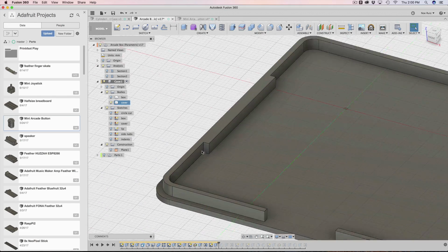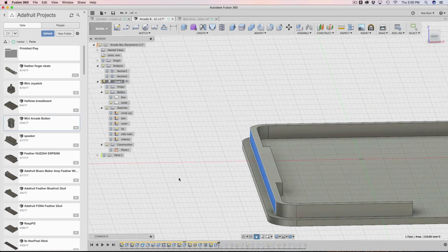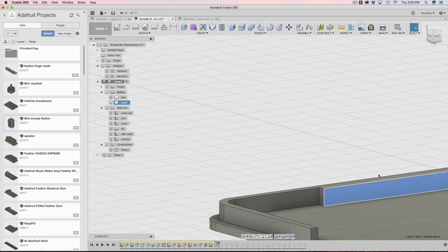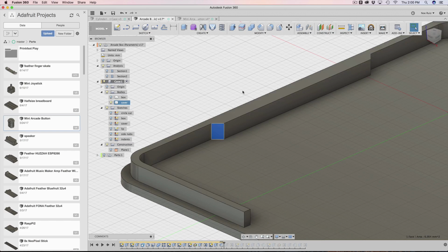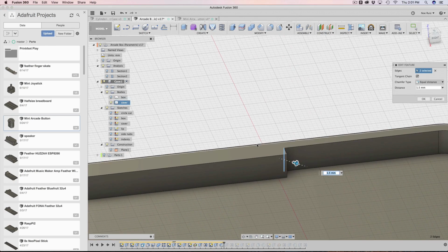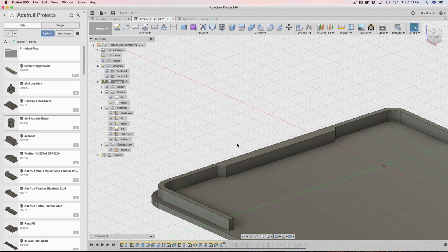So we're extruding the inset here because we need to have this extra material here, because if we just cut here first for the indent for those nubs, then we wouldn't have any material here because we would be cutting through this whole thing. So that's why I had to add some extra part here. And then what I do is I do like a little chamfer here on the edges. Unfortunately, you can't add a chamfer. If I were to do this, it kind of does that, and that's not really what I want. So I just chamfer out these 2 edges here, this edge and this edge here. You can go into it and I'll show you exactly which edge. So it's actually not the outer edge, but the inner edge, these guys here, and that just kind of rounds it off there a little bit nicely. It's to accommodate for that taper that we did with the nub.